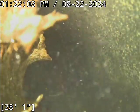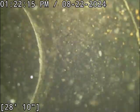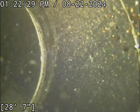All right, coming into some standing water. Oh, never mind. At first glance, I thought that was a bunch of busted pieces of clay pipe there. And right now, again, my camera is at a funky angle. This piece of pipe right here is incredibly out of grade. I mean, we're going uphill at a 45-degree angle here. So that is something I will certainly recommend a repair on.